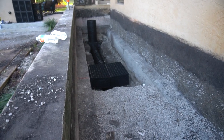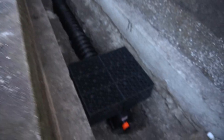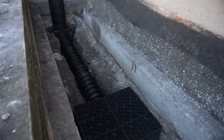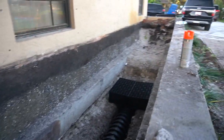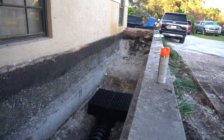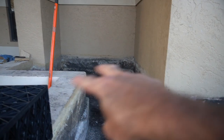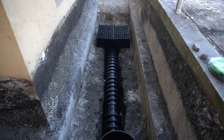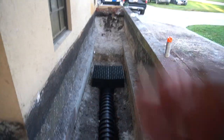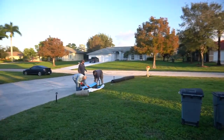The guys have cut all the material out and hauled it away. On the bottom here is our wetland filtration system — this is going to be an upflow filter located on the bottom of the pond. Franklin is going to load this up with beautiful koi and we didn't have much room, so we needed a creative solution. We'll have a skimmer on one side discharging water into the bottom to create an upwelling area, and the rest of the water discharges to maintain flow back to the skimmer. It's a very weird shape but will look awesome — a modernistic design transforming a simple raised planting bed into a beautiful koi pond.